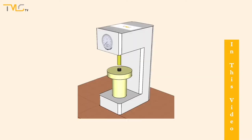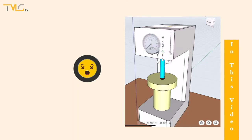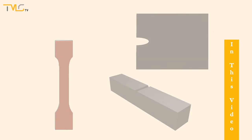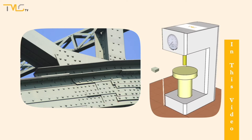Hardness is briefly the resistance of a material to indentation, and it is measured by simpler testing methods compared to the rest of the mechanical tests in terms of the experimental procedure and data analysis. One of the major advantages of hardness tests is that there is no specific specimen geometry requirement — so long as the part fits the setup, the hardness test can be conducted on it. Otherwise, a small sample can be taken from the part and the test conducted on it.